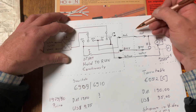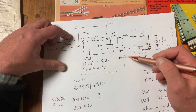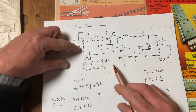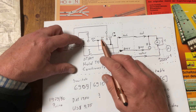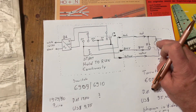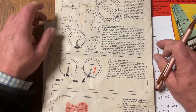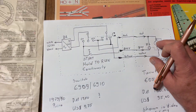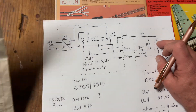All of this is inside the turntable itself — the bridge that is underneath. These wires go through a slip ring in the center where the wire is attached. We have the yellow wire connected to reverse the polarity for the motor. This is a DC motor, so don't be fooled when it shows you that the system hooks up to AC — that's because of the integrated bridge rectifier, which is not mentioned anywhere in the documentation. This is, I think, where most of the confusion comes from.